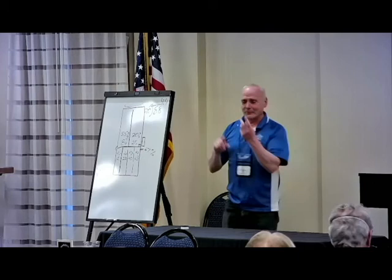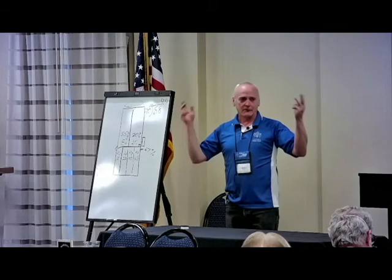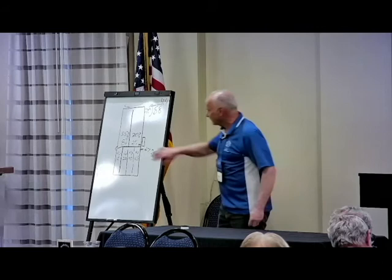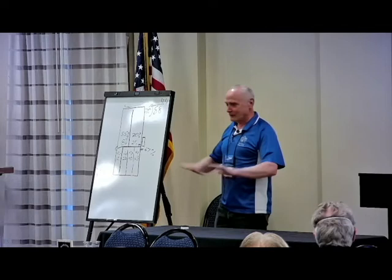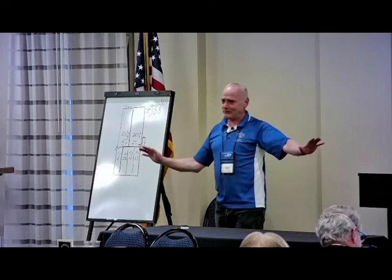So now we've got steady foam and steady heat. The next one is steady feed. Have you ever been in your neighbor's sugar house when you hear this kind of conversation? I'm going to draw syrup. Can you go lean on the float? Okay, now you just destroyed the steady feed. If you stand on the float, how long does it take that to work all the way around here? Your draw is long since finished before you get there.